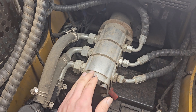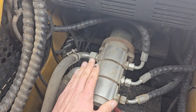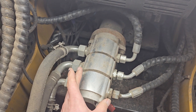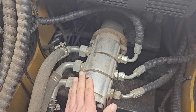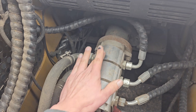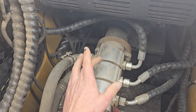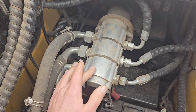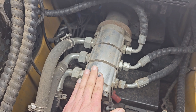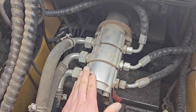So basically we have a three-stage pump. Let's say there's 15 gallons per minute total flow in these pumps - it's actually about 14, but we'll use 15 for easy math. Each one of these pumps here pumps 5 gallons per minute of flow. There's still only a total of 15 gallons that the machine will pump, and what kind of sucks, as Natster explains...